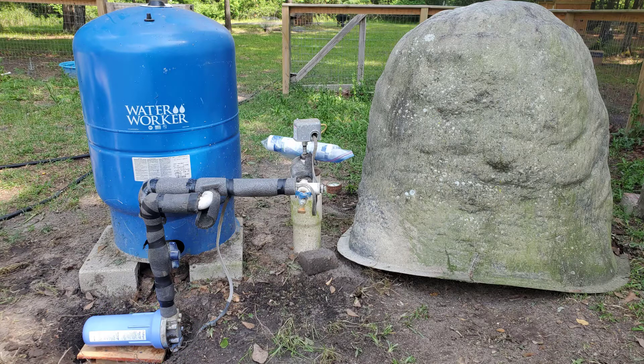The filter in this well needs to be replaced every two to three months. While the cover is off of your well, use this time to inspect for insects like ants or wasps or other animals. Rake out any debris that's accumulated and check your pipe insulation. Replace any that's worn out or torn.